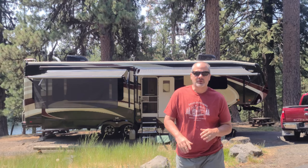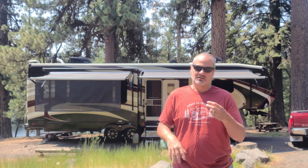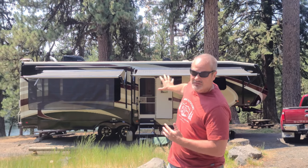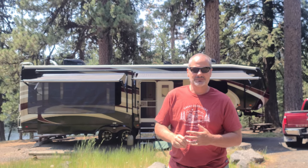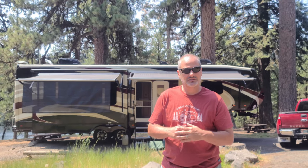Here at this spot we get a great amount of sunlight from about 8 in the morning to about 2 in the afternoon, so this is fantastic for our boondocking adventures. You might be asking why we're upgrading from 600 amp hours — six batteries — to three batteries of 270 amp hours totaling 810. At this location it's not immediately obvious, because we have plenty of solar, about 600 watts on the roof, and we get back to about 95% charge every day.